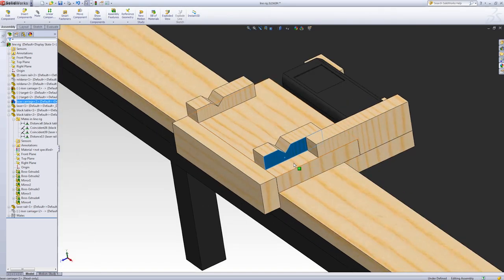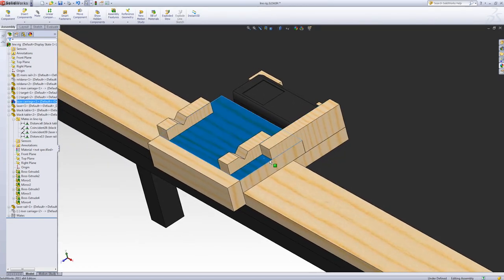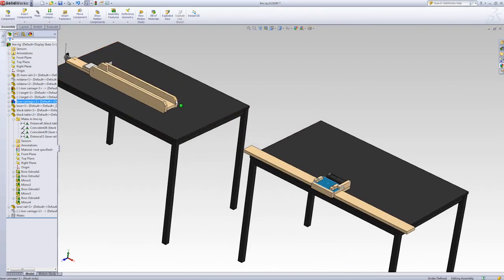So on this carriage, we have the face on which that line tab will sit. And the laser can measure either from the back face or from the front face. So I think I'll probably just use the back face, and it has some buttons. So you can put the line here, pull it back, tension it to 5 kilos, press the button and take a reading. So it's pretty simple stuff.